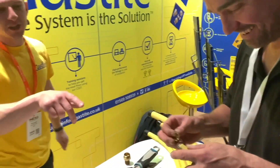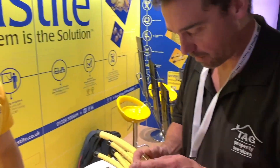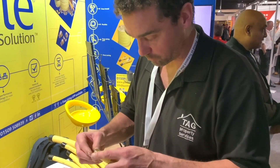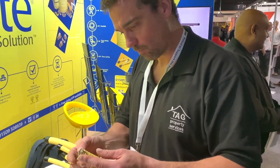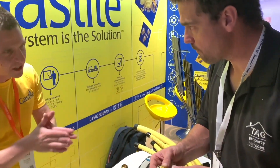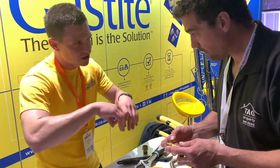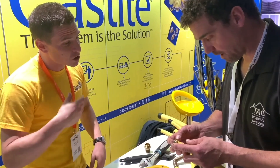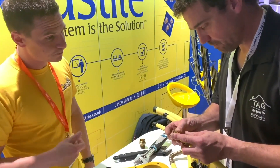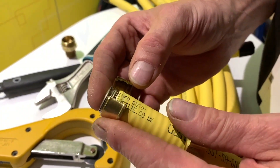Tom advises: if you've made a bad cut and don't have a seal, there are two possible reasons - you cut it badly, or you haven't prepared it correctly. If cut badly, take a bit off and re-cut and try again. Make sure you've got enough length on your pipework to do another cut. You'll probably cut it badly at least once or twice when learning.